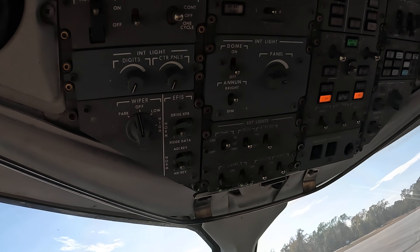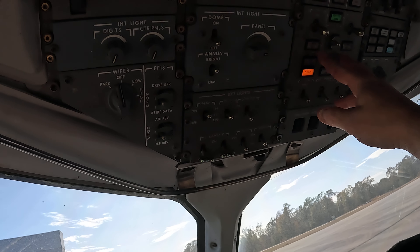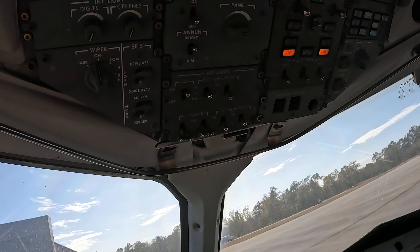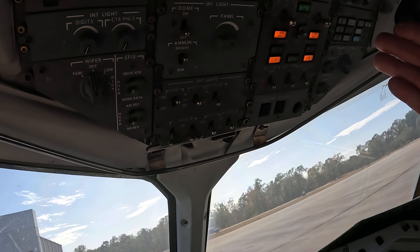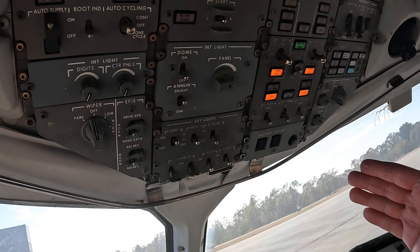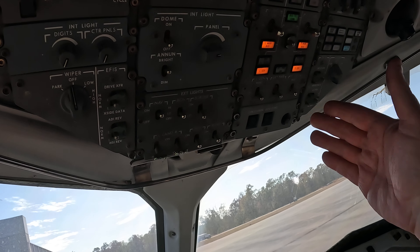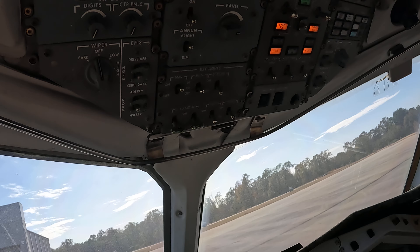Now this is the important part. I wait until my main bus lights come on before I shut the engines down — so as not to damage the PDUs. My main bus lights have now come on. Obviously my inverter light comes on as well, telling me that's no longer powered because we shut down the generators. It does take some time for those main bus lights to come on.